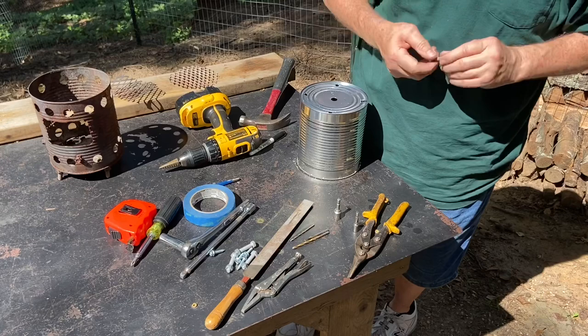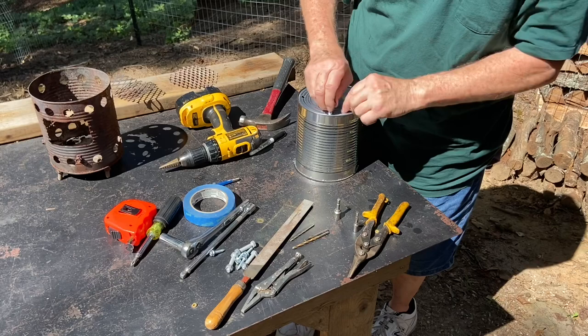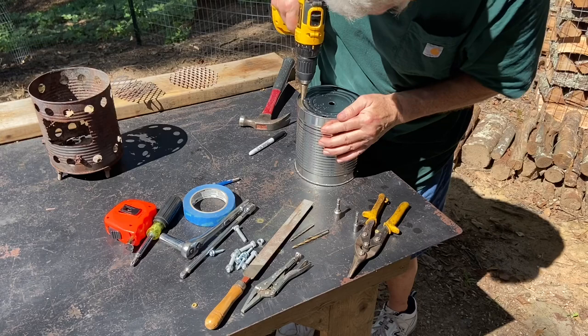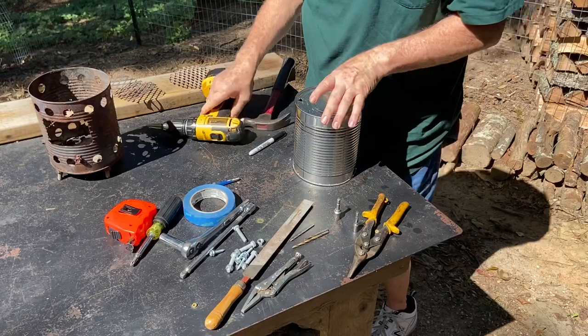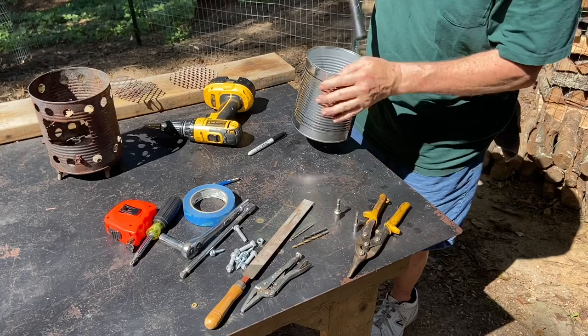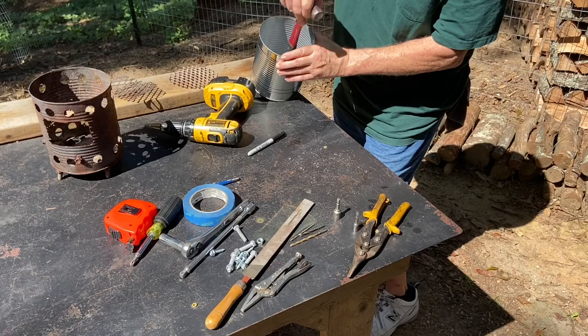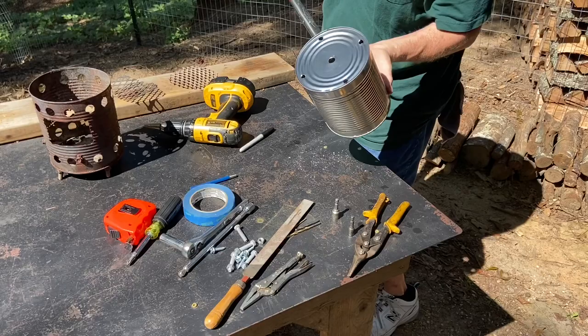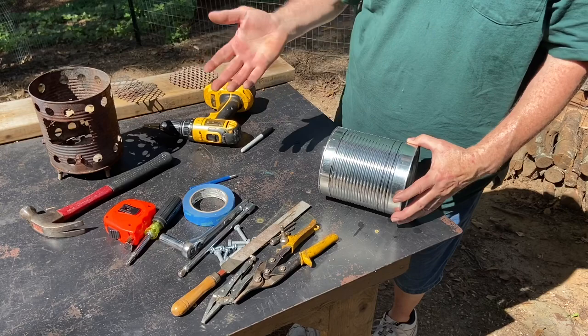5/16 bolts. I'm gonna have to go to the next step bigger. Yeah. Let me give it just a little bit more. And I like to take where this drain hole is at and make it sort of bow towards the drain hole. That's good. All of these holes, top and bottom, are 3/4 inch, and they're 1.5 inches apart.